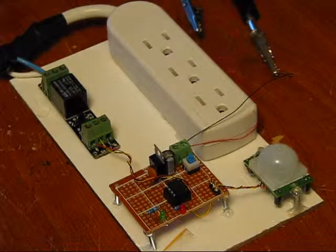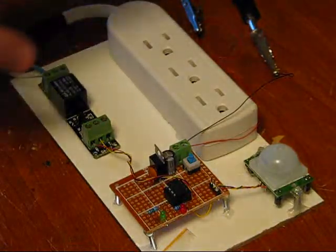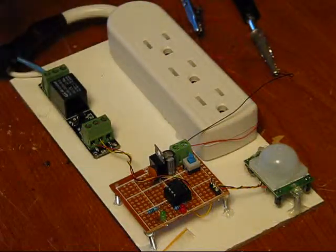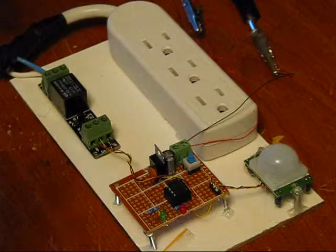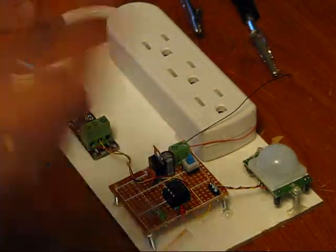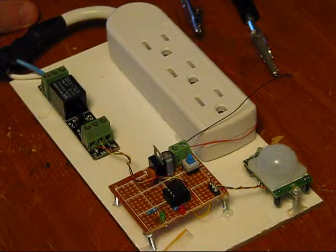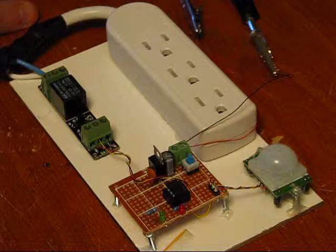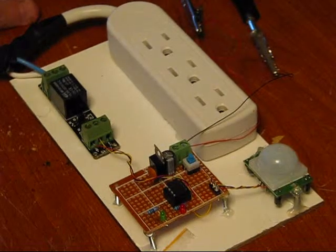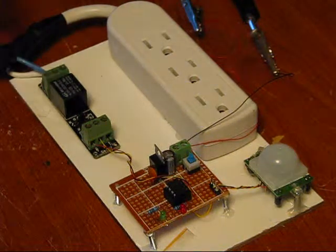So anyway, here's what happens. When you turn on these passive infrared sensor modules, the output is often unstable for about 50 seconds after you power it on. So I offer a calibration state on here. The chip basically says, okay, power on, we're going to wait 50 seconds, and then we're going to start scanning. So after 50 seconds, this red LED will come on. And that'll essentially say, okay, all bets are off, we're legitimately scanning here.